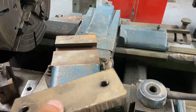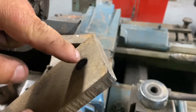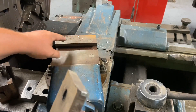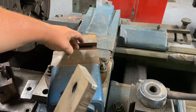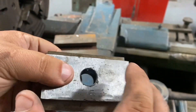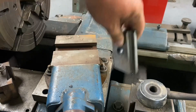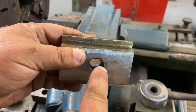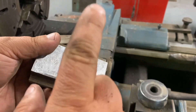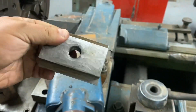The important part, whenever you use a bolted part into a compound, is the bolt length. You don't want the bolts to go through this and into the bottom here and act like a jack bolt — that's how these get broken most of the time, from people's hold-downs. That's why when you make tool posts, what you should do is make a shaft with a thread on each end. You don't want to put just a plain bolt through there, because if it's too long it will thread into the bottom and act like a jack and break it out. Typically you want a stud with two threads, one on each side — it threads into here and is flush or a little less, so that can't happen.